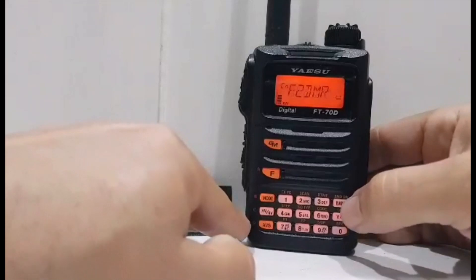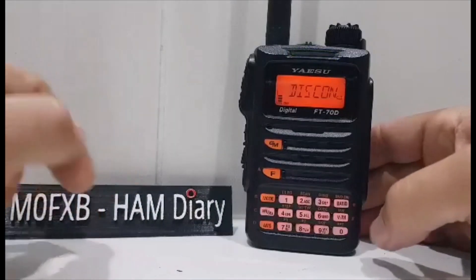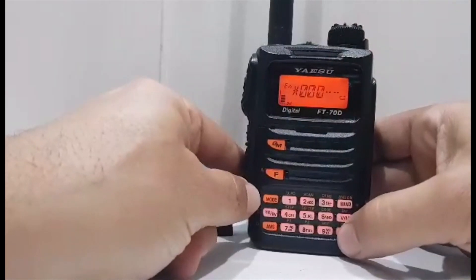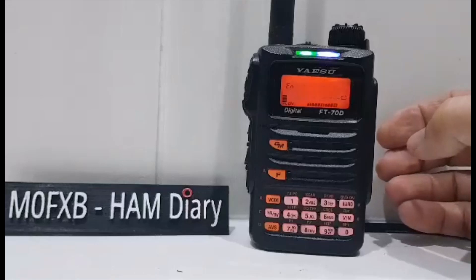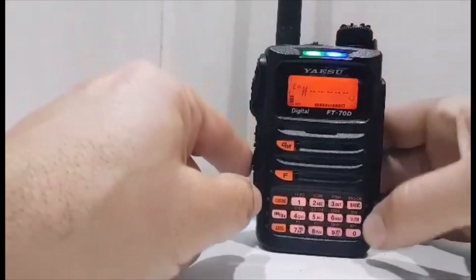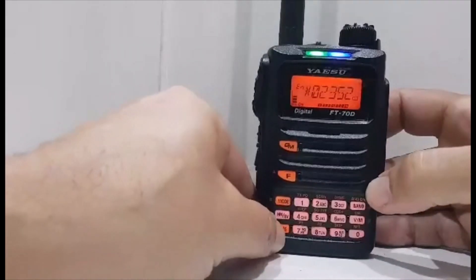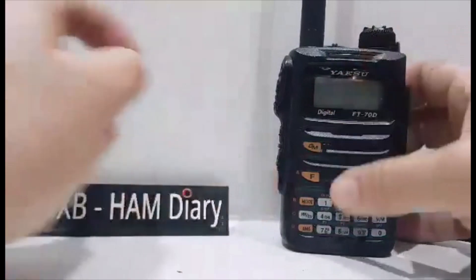So as you can see, it works. The main summary: you can disconnect yourself by holding down the band button. We're now disconnected. If you want to connect to the YSF, go F then AMS. Turn the knob to enter. First go to 0002, just to make sure you're in the cross-mode group, and push AMS. Then to connect to a different group, turn back to E and choose the talk group — 2352, for example. When there's no one talking, just push AMS. You can see it's very active at the moment. But I hope this helps. 73, all the best.